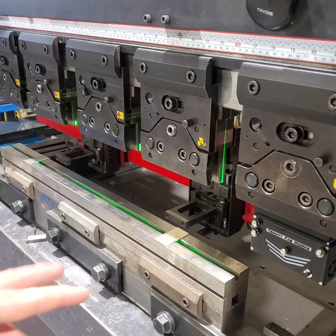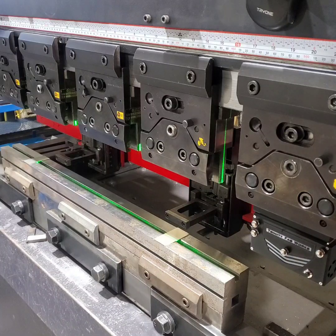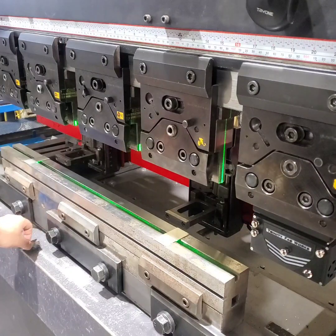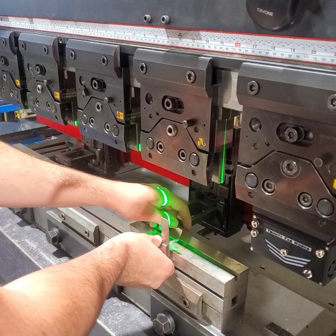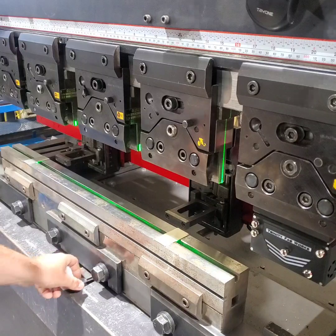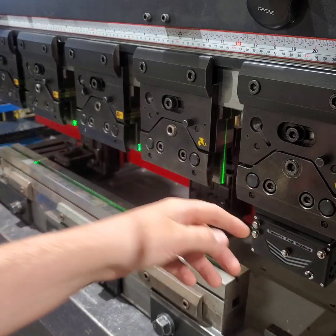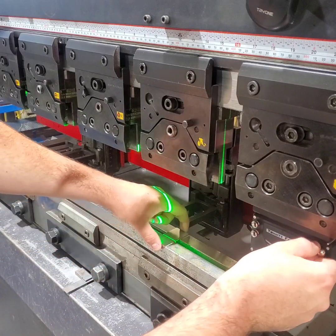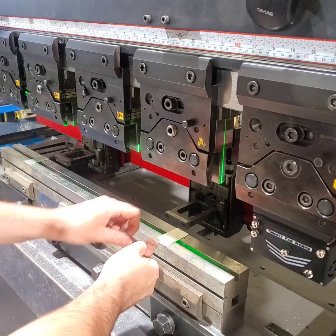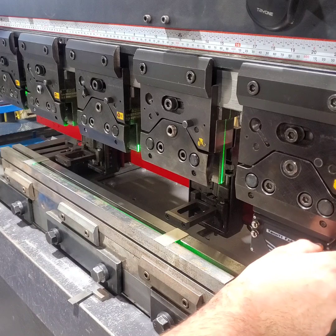Basically, throw those two plates a couple feet apart - 24 inches, it's not an exact science. Then you can either use your back gauge on a smaller die with a 30 millimeter offset, or put it on a 60 millimeter lower and hold a 1-2-3 block or a squared edge up to the bottom of it and push it up against it and you're good to go. You can adjust the pivot direction using these two adjustment knobs, and if you rotate one of them you can see the bottom start to move.